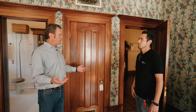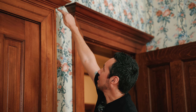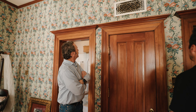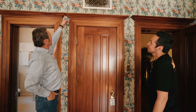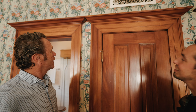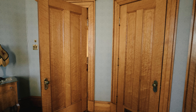If we want to build better today, clients have to ask for more — that kind of detail is beautiful, but it is more work. Notice what's happening in these rooms — we've got quarter sawn white oak here, but when you come into the room, look what happens: we've got mahogany. During that Victorian period they would often have different woods in different rooms. One thing I noticed is that miter right there — the spring angle of that crown follows that line, which is really amazing. You get that same angle, that same line through casing and crown. It's almost like someone had a passion for craft.